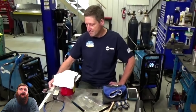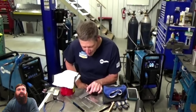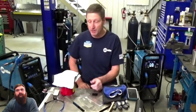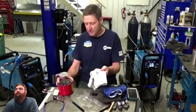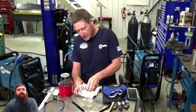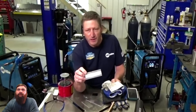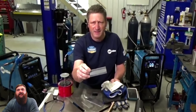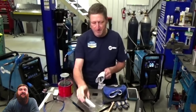Also, once you start cleaning this stuff, keep in mind you also want to clean your filler material if possible, because that's got the same oxide layer on it as well. After brushing, you'll notice there's some oxide dust on the aluminum — you can wipe that off. This is where you use a little bit of acetone in a plunger can and just wipe that off. You can see exactly where you brushed it just by looking — where it was brushed, the light reflection looks different than the rest of the coupon.